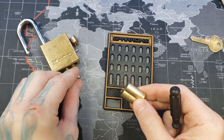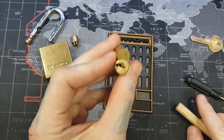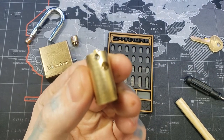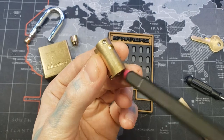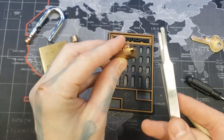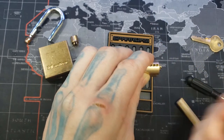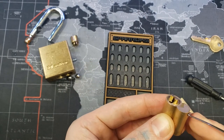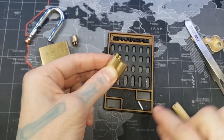So that's the entire lock right there. On the back of the core there's a retaining pin right here in the back. What we've got to do is get that pin out and then we can remove the core. This one actually slides out pretty easily — I hit it enough and it usually just falls right out. There we go, see that one just fell right out.